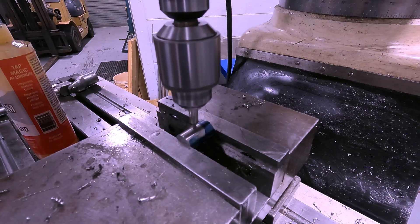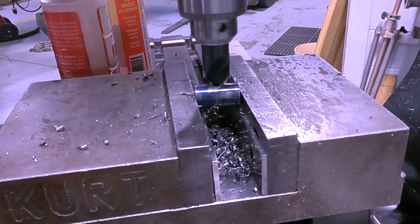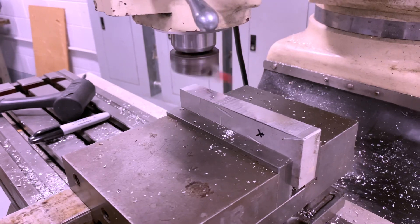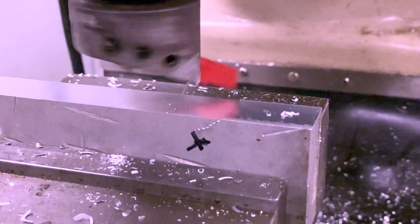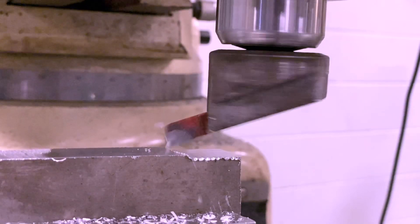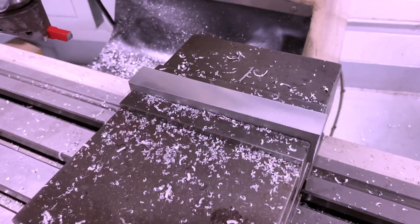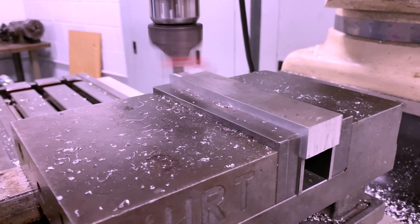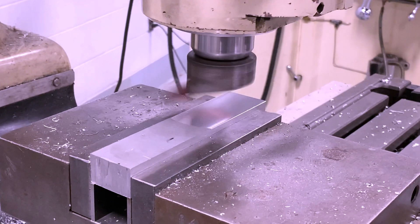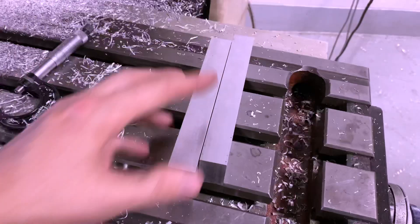The cylinder pieces received a hole drilled through, and one of them was tapped. Next I start on the most complicated pieces — I'm using a fly cutter to square up the faces of the rough aluminum. Look at that finish. Oh, so satisfying.